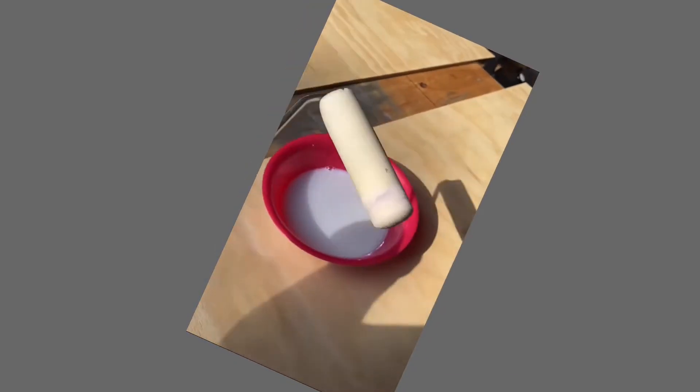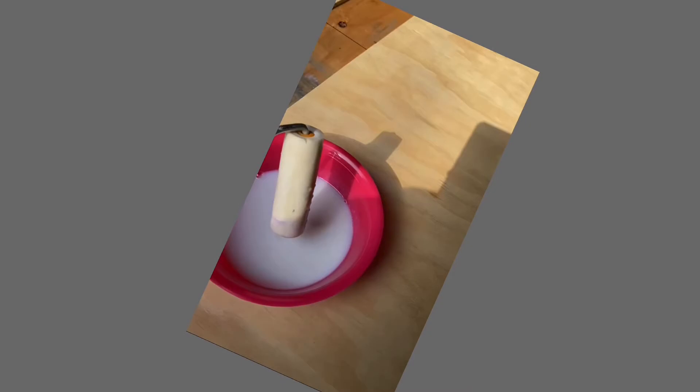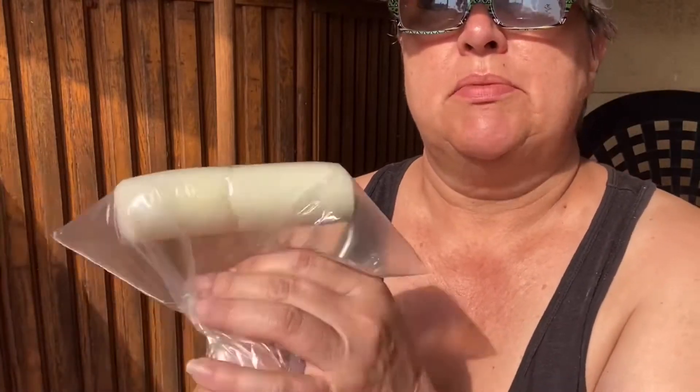One thing I'm doing differently is I'm actually going to use my paint roller. We've normally only ever used a brush for this, but I figured there must be faster ways of getting this done. There's something else I've never done before either — because this varnish dries quite fast and it's a lovely sunny day — if you put your wet brush into a plastic bag it'll keep it moist so you don't have to keep rinsing it, wait until it's dry, and then dirty it again. We'll see how that goes.